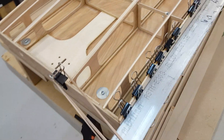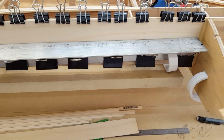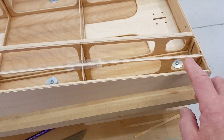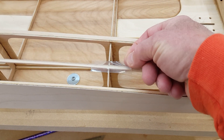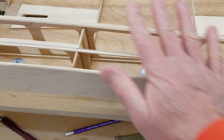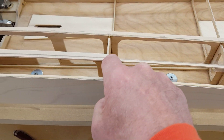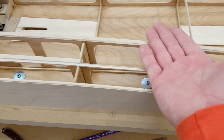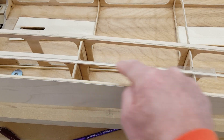Don't care what you've got to do to hold it - clip it, do whatever you need to hold it straight and slap it on. Now the decking. Here's the trick, and I got this idea from David Brant. Remember, I don't want it epoxied all the way along here, and you don't just want to seal it and then seal the deck and wait till it dries and assemble it, because it'll get hot and that epoxy will get sticky and it'll stick.